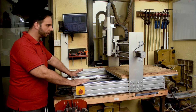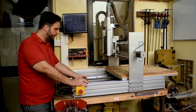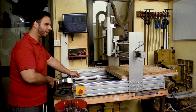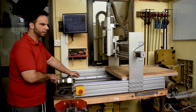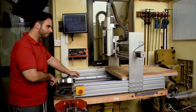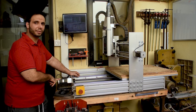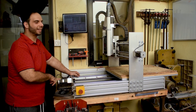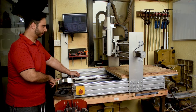I'm using 16mm diameter lead screws and NEMA 23 stepper motors. I found a good deal on eBay on these stepper motors — if I'm not mistaken, these are the 400 oz-in torque ones, which is quite strong for NEMA 23s. They're good and reliable. The only drawback about stepper motors is they're limited regarding speed — they have good torque, but speed-wise they're not ideal. If you want speed, you can go with DC motors, but that's a whole other story.